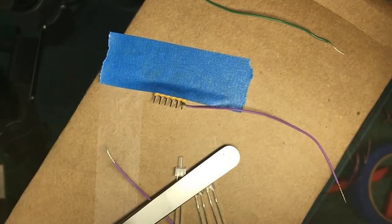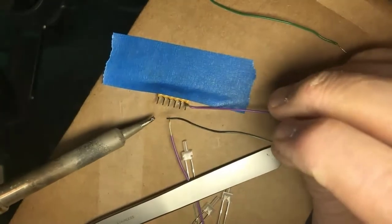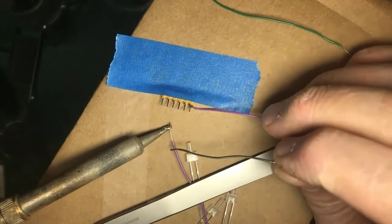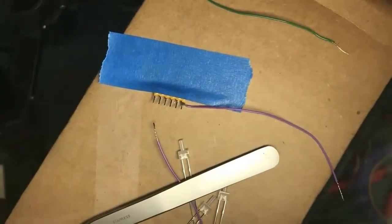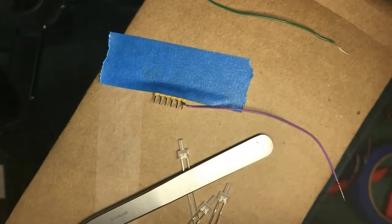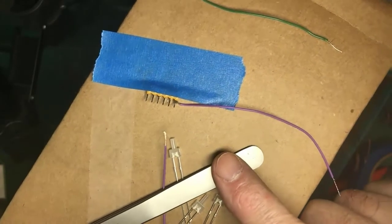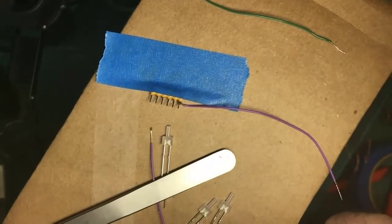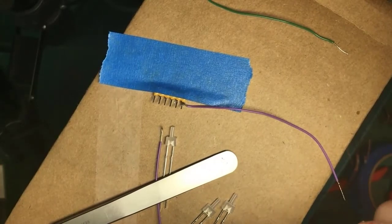Clean the tip of the iron. The wire in the field of view, yes. Wet the tip. And then I just run down the wire. And it is tinned. Again, using rosin core solder. On fresh clean wire like this, no need to use rosin paste flux or anything like that. If you had old wire and it was green, you should throw it away.